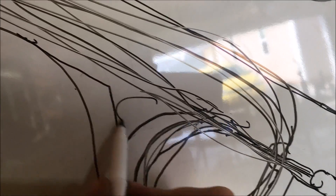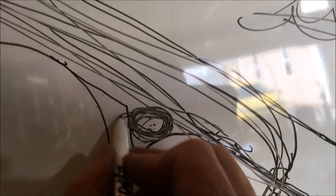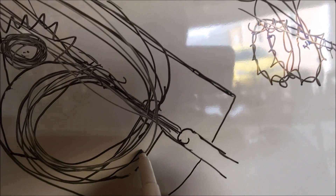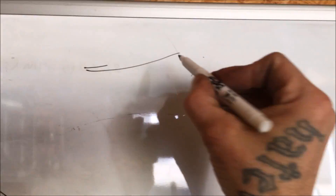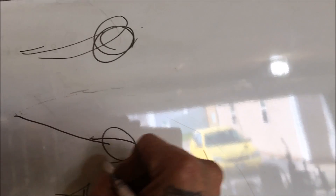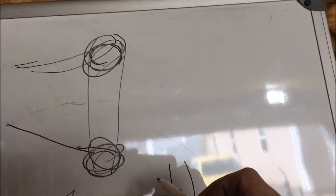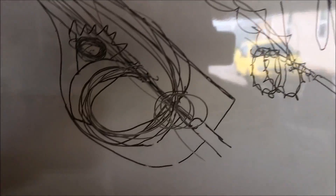In addition to that, we also have another little eddy taking place right here. It's burning so hot that this area is white hot, and that little fireball is continually igniting the burner. Same thing with this swirling jet — we have a fireball traveling down and being forced back up through the point of ignition, so we have flame stabilization. Typically in a jet engine, they would create this vortex — it's a toroid, a toroidal vortex. I can't draw you a three-dimensional toroid, but it's a fireball shaped like a donut. This is a little bit different — not quite a donut, more like a pretzel burner.